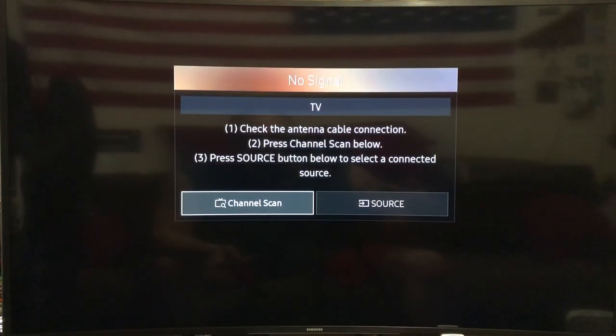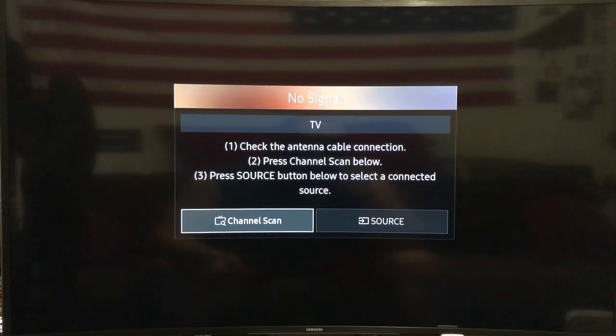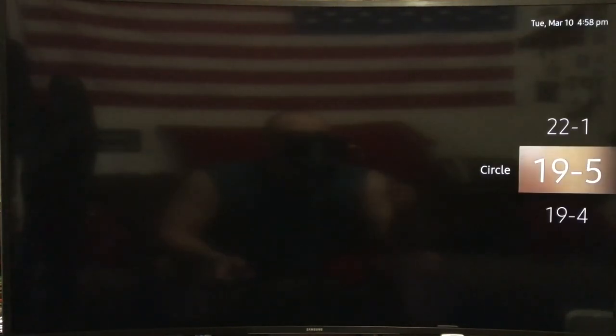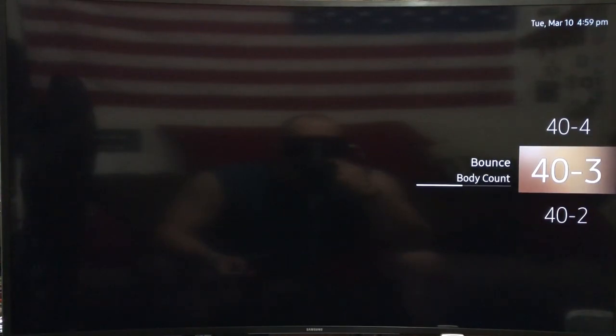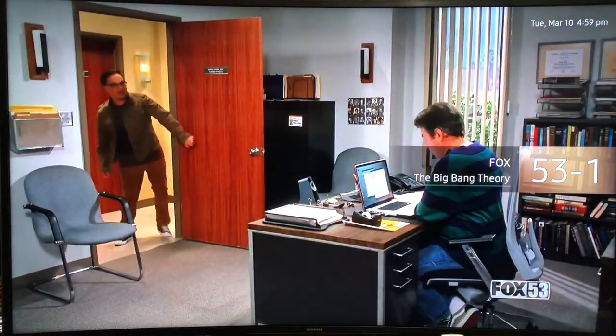I want to point out that this TV is a Samsung, and the TV in the living room is an LG, and it seems like LGs have better tuners — it'll pick up channel 19 and it won't pixelate. When 19 is pixelating on this TV, the LG will probably just pick it up altogether. So it must be a better tuner, because I had an LG previously and it was also very good. Most channels are just fine, there are a few borderlines, and I'm hoping the amplifier will keep those — because if I'm picking them up that well, I'd rather try this route before deciding to get a better antenna.